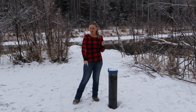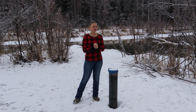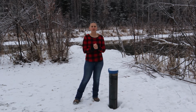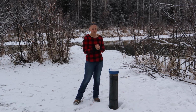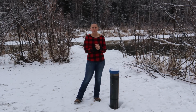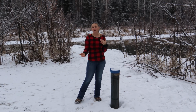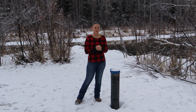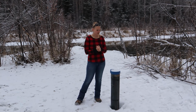They ended up coming in and digging a trench all the way up underneath our house. I think it was about 15 feet deep. It was pretty deep. They ended up taking the line that runs the water up under our house into our well pump, wrapping it in foam and in heat tape that we keep plugged in for most of the year. If you need a jacket outside, you should have heat tape plugged in.